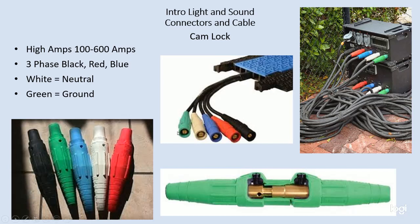I'll finish this unit up on connectors with cam lock. Cam lock is really how we start to move big power — 100 amps to 600 amps — it's really how we're moving a lot of current around any sort of portable power system. If you take a look at these connectors here, you'll see that each one is its very own individual conductor. We have three separate phases: black is A phase, red will be B phase, blue will be C phase, white is the neutral, and green as always is the ground. So we're carrying three hots, a neutral, and a ground at between 100 amps and 600 amps.